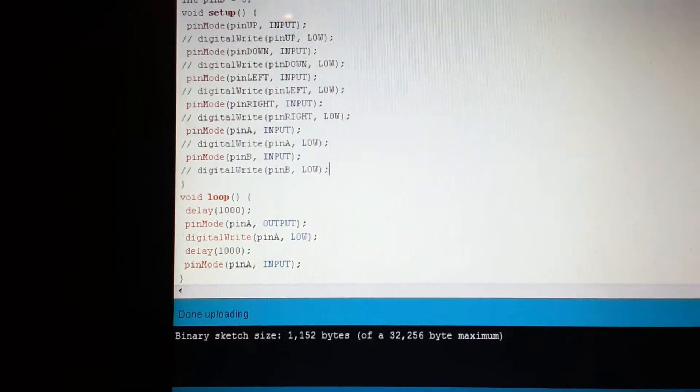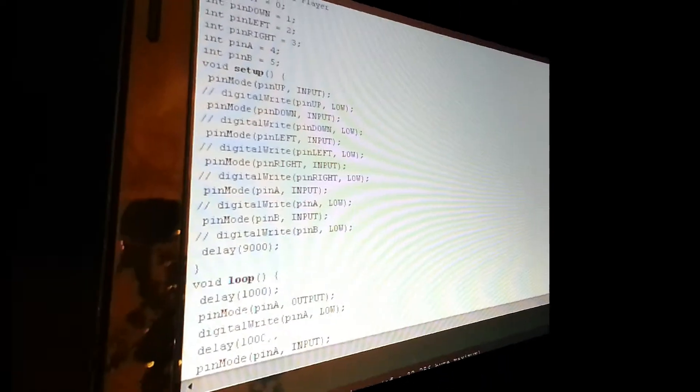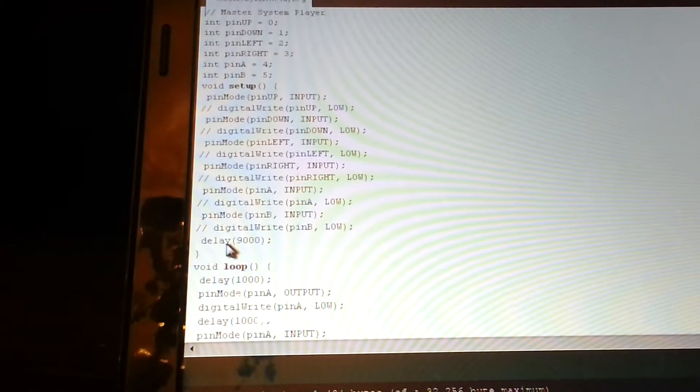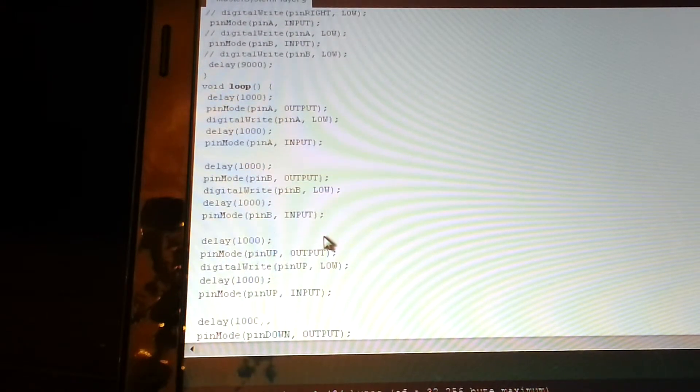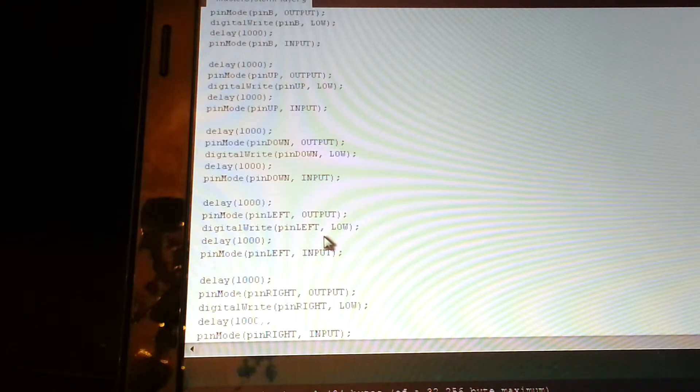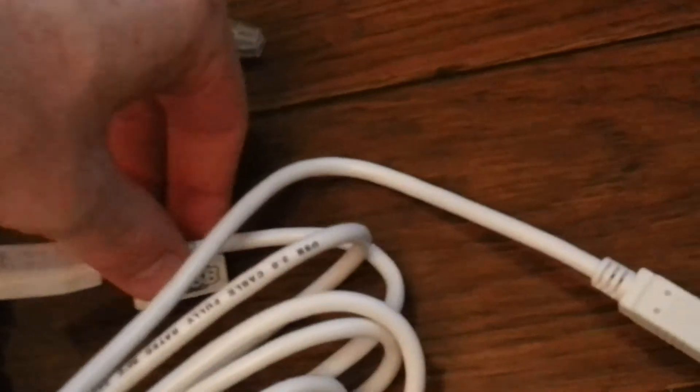In that loop function you can do a lot more advanced stuff. I'm going to go through and change this function to test all the buttons and make sure they work as expected. So that's the code change — it now cycles through all the different inputs and tests them all. I've added a delay to the setup so the system has time to start up, power on, go past the Sega logo, and then we drop into the main loop where we go through each button — pin A, pin B, up, down, left, right — waiting for a second for each button press.